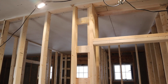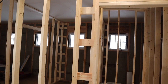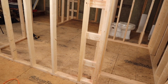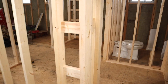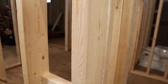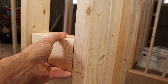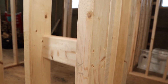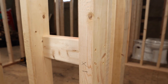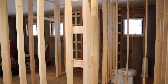Okay, this is the last example. This is short ladder blocking, and I'll end this view by showing you a close-up of something really stupid that I did — a mistake that I made. The blocks are fine here that I'm showing you top to bottom, but the mistake I made is right here. You see these two holes here and two holes here. What I did was I put my ladder blocking out here where no wall is going to intersect, and I had to take all the ladder blocks out and move them over to the other side. I realized after I did that it was time to hang it up for the day — I was tired. Okay everyone, thanks a lot for watching.